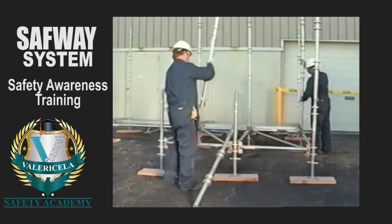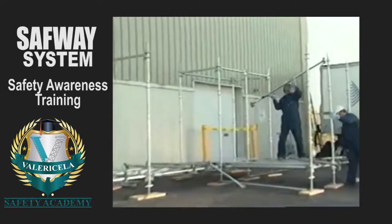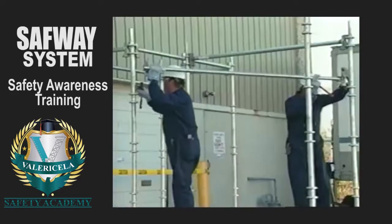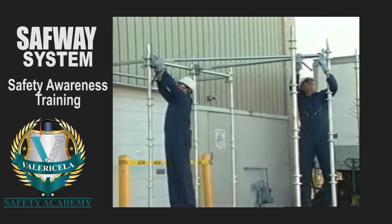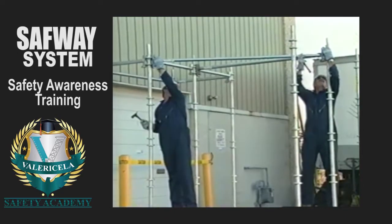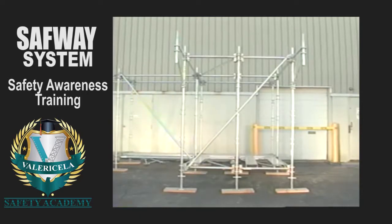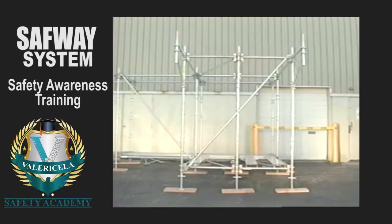Vertical posts are installed on top of the starter collars. The second level horizontals and a horizontal diagonal are placed and locked into position. The diagonal is placed in the bay which will not contain the stair units. If brackets are to be used for the landings, install one vertical diagonal on the end of the stair tower opposite the base landing. If legs are to be used to support the landings, install two vertical diagonals per lift, one on each end of the stair tower.